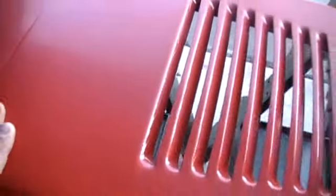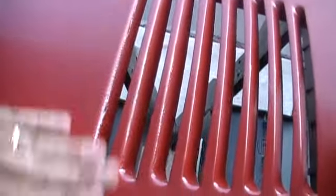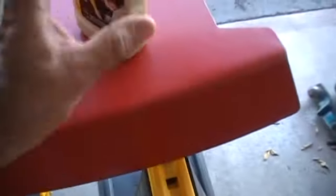Fix up this top. This top is wet-sanded. You can see it's got a light, like a satin finish. Taking a 2000 grit paper to it to get all the orange peel off, and now I'm going to buff it.